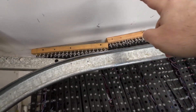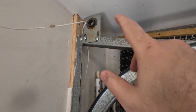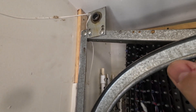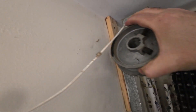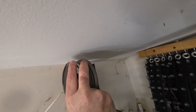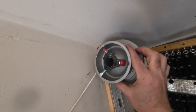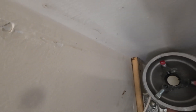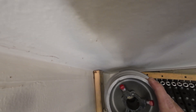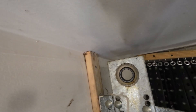Technically, from this point to the ceiling, if you have about six inches of clearance, you're fine — the door will clear it. It's the pole where the pulley goes that matters. Since I put a high-lift pulley, I need to make sure the high-lift pulleys are a lot larger. Let me show you an example of the pulleys. This is the regular pulley that it comes with — it's supposed to sit like this. Now, this is a high-lift pulley. This is as close as I can get it to the ceiling. Anything higher is going to hit the ceiling, and I don't want that — so that's as high as I can go.